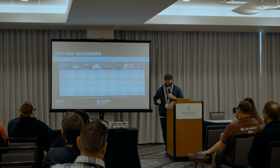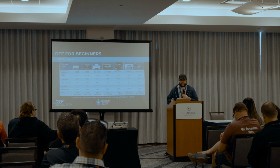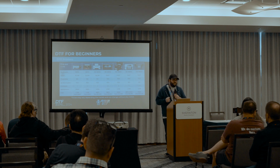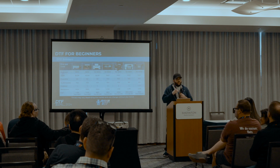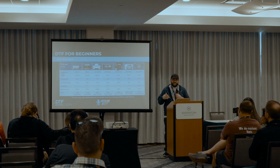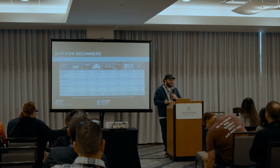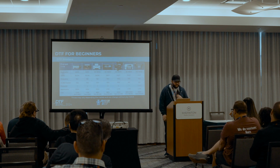Print heads, the first three use only one head. Again, it's going to determine how fast it's going to print. And the rest of the printers, high-end printers, 2 heads, even 4 heads. So it's going to be fast for you. On maintenance, the first three are going to be high. They're going to have high maintenance because those printers were modified to do DTF. They're not supposed to be doing that, but you modify, people use it today, and they got good results. I mean, we started that way, and we can see that those printers work, but they're going to require major maintenance daily. For example, every 2 days, maybe 3 days or 5, okay?